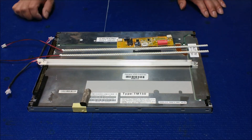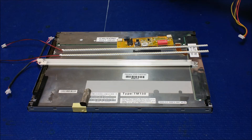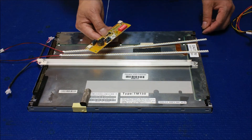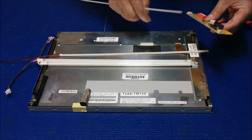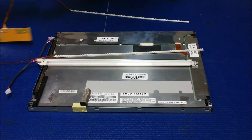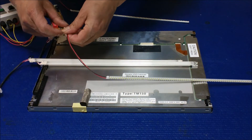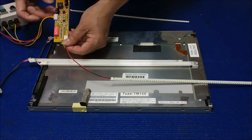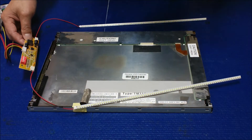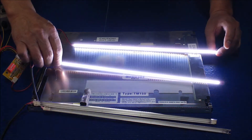We need to test the LED strip first to make sure that all LEDs light up evenly. I have the ITO2 here, already configured to the correct pin assignment on this MS456UB LED converter. So we're going to test the LED first. The jumper is already set to seven. All LED lights up — no problem, it's good to go. Disconnect it and set it aside.